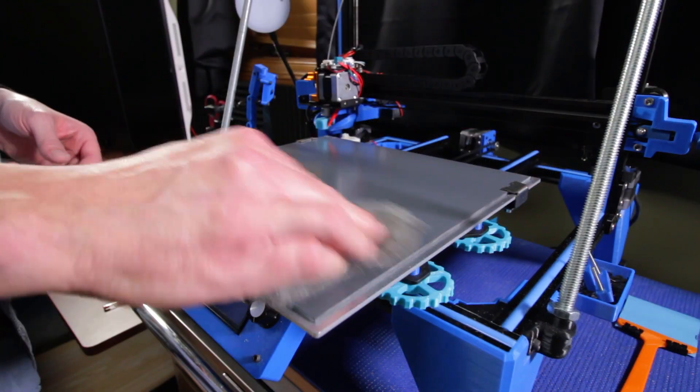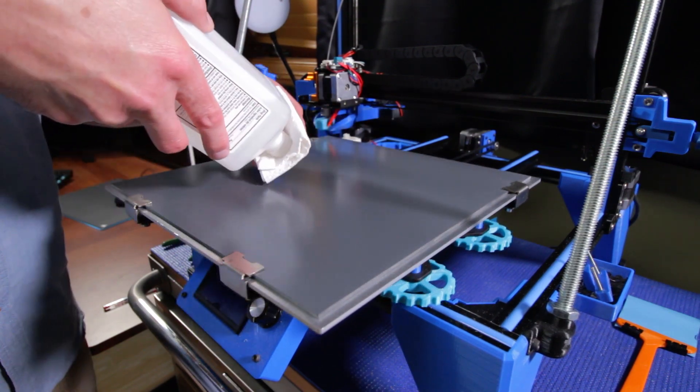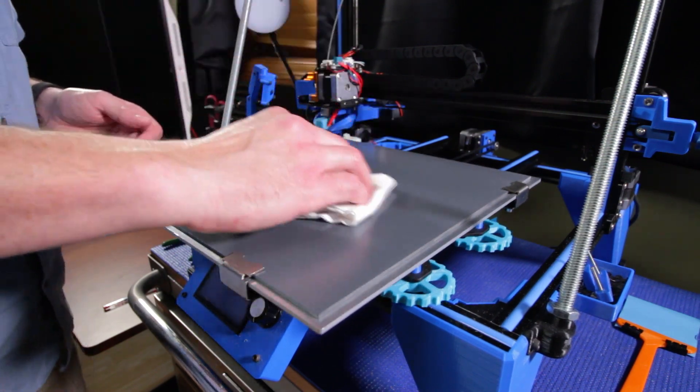In a nutshell, you should be able to use the same slicer and temperature settings you're using now, but feel free to experiment. If you happen to have a mirror tile, just flip it over and give it a try. I do recommend cleaning the back of the mirror tile before using it — I did this by scrubbing it down with 4-0 steel wool and then cleaning it several times with isopropyl alcohol and a paper towel.